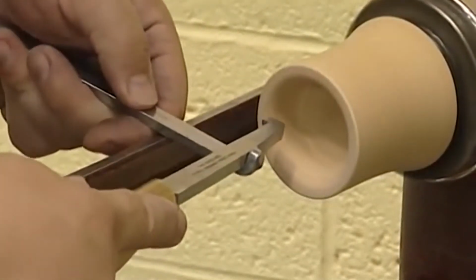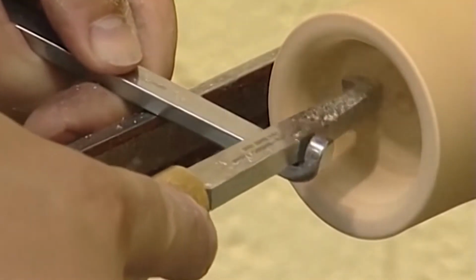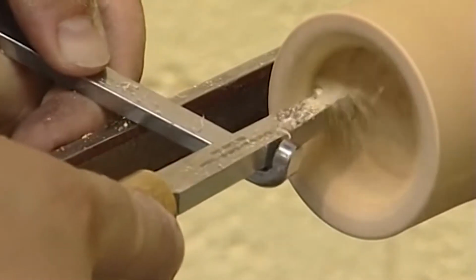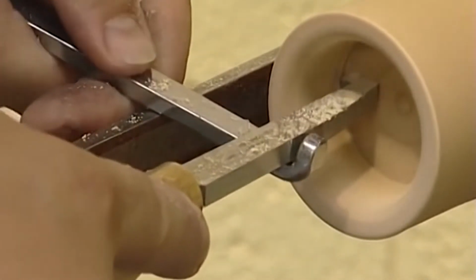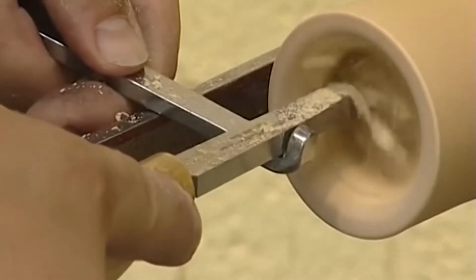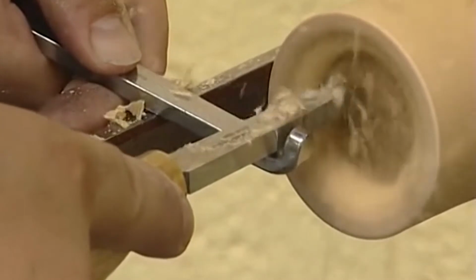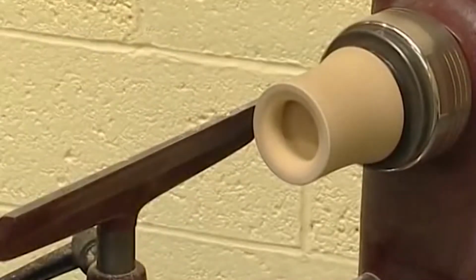Now the relief cutting tool is used to true up the base and the side of the recess, and then creates a recessed area at the end of the section that we propose to thread. The recess this tool produces forms a safety zone that allows us to remove the thread cutting tool before it strikes against the base of the workpiece. With no safety zone, any thread still within the cutting tool will be immediately stripped off.